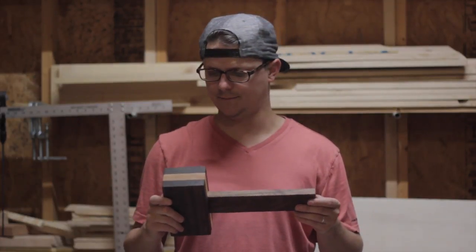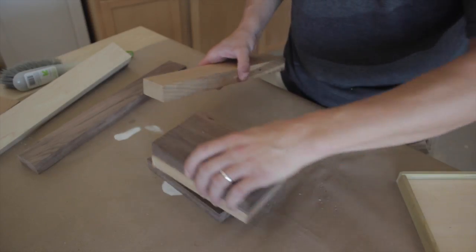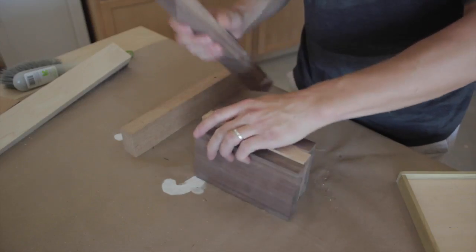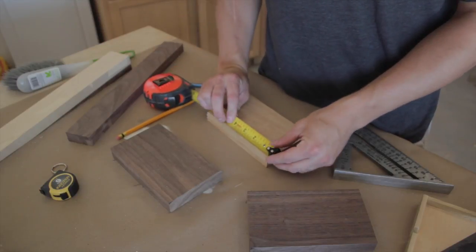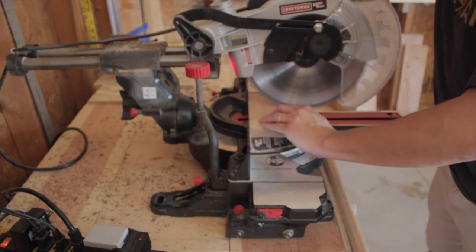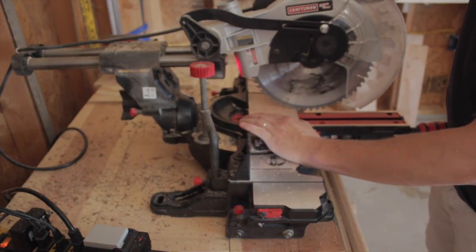I learned something new here and I'm actually pleasantly surprised with how it came out. So if you have any comments, suggestions, or criticisms, you can comment below. Now check out the video of the build. I initially started with an oak handle that matched the center portion of the head, but quickly noticed it was too thick and didn't match up perfectly. So instead of cutting it down on my table saw — which is just a homemade table saw with a circular saw that causes some problems with hardwoods and kind of hangs up — I used a walnut handle. Here I'm just finding the center point of this piece of oak and using my speed square to scribe a line and take it over to the miter saw.